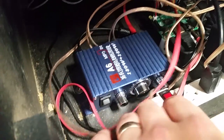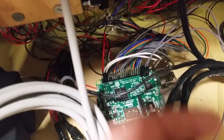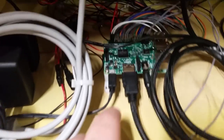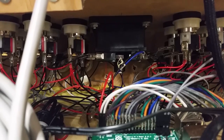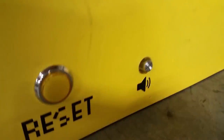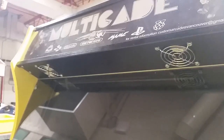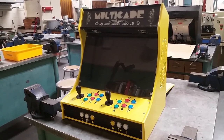Here's a look from inside the black arcade that I painted — just different speakers, I used a different amp that cost me about $30, though I've seen them on eBay for about $10. And here's my yellow arcade. This one has LED buttons, so that means there's even more wires — that's a Raspberry Pi 3. Each button requires two extra wires for positive and negative of the LED. There's my reset button and the audio amp again — the problem with them is the wires can fall out very easily. Here's a quick visual of the CNC cutout. We used a vinyl cutter to make labels for them. I used little fan grills from an electronics store to cover the speakers so people wouldn't poke them with pencils.